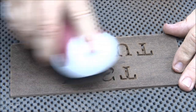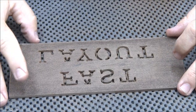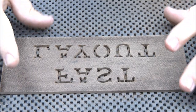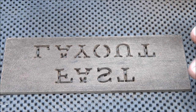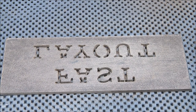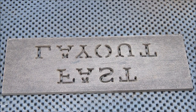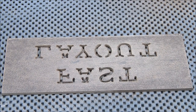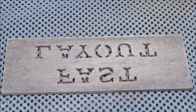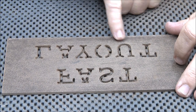Okay, there it is. Now, a couple things to really be careful of. If you're cutting with a straight bit — I know some of you cut with an eighth-inch straight bit — then you wouldn't have to cut from the back side, because it's a straight cut all the way through. I like my profile cutter because it's my favorite bit and I love the way it cuts. If you use a straight bit you wouldn't have to do this second operation.